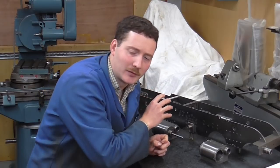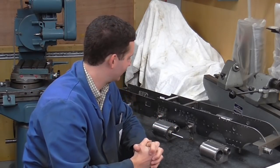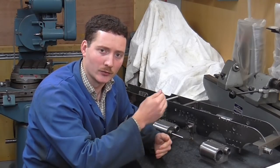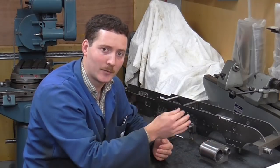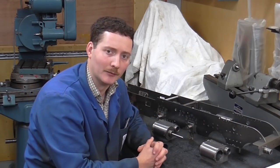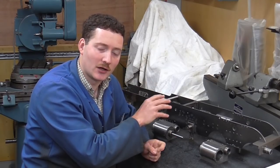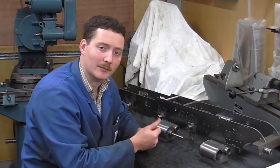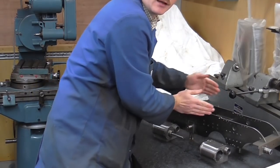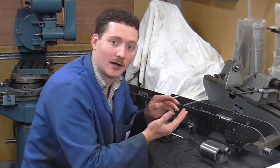Those are the main points about the locomotive, but a few other points revolve around your circumstances and machinery. It's mostly a question of thinking: what machinery do I have access to, and therefore what locomotive can I build? Over the course of a whole locomotive it's going to get pretty tedious if the machine you're using is either too small or greatly too big. Think about what size equipment you've got and then consider matching the size of the locomotive to that. One nice thing with locomotives is that some designs are quite common across different sizes. The most common three sizes are three-and-a-half inch gauge, five inch gauge, and seven-and-a-quarter inch gauge — that refers to the spacing between the wheels.